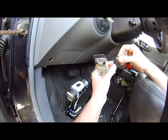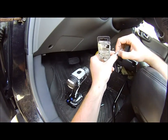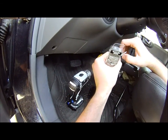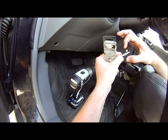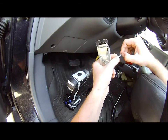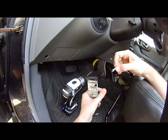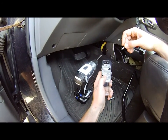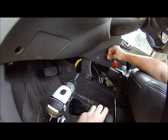Mine was about a half inch. If you measure this anchor, I figured it was like three-eighths from the flange to the tip. So when the anchor starts bunching up it's going to pull back against that material and be fine. If you get one that's an inch long and you've got half-inch material, it's going to have a problem bunching. So I'm using a 6-32 screw with an inch-and-a-half bolt. You stick them in like this.